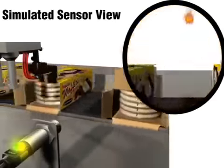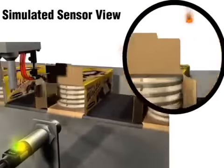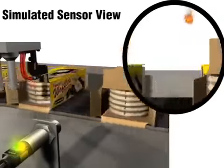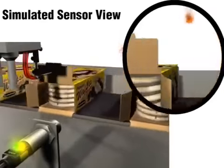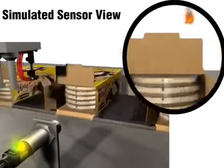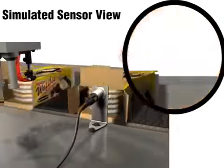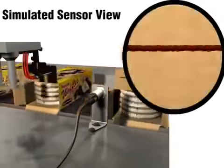Additionally, if there's a hot event in the background near or within the sensor's field of view, this will figure into the background temperature. Just like when there isn't enough contrast, the best tactic is to move the sensor closer to the target or switch to a sensor with a narrower field of view in order to crop out the hot event.